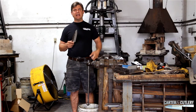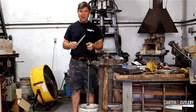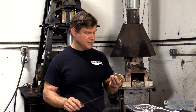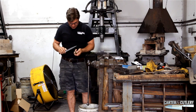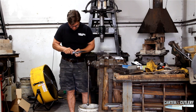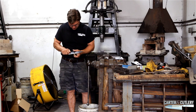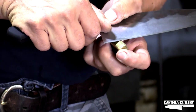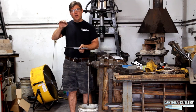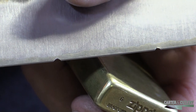One thing that I'm prone to do when I get a knife back into my shop that has chipped — whether it's one of my knives or somebody else's knives, because we sharpen everybody's knives — is I'll pull out a lighter out of my pocket. This is a Zippo lighter; it's got some round corners. I'll put my glasses on for safety, and I'm going to flex the edge by pushing it down at about a 30-degree angle to the corner of my Zippo lighter and try to deflect the edge. I want to see that steel ripple away from the pressure of the Zippo lighter, and then when I remove the pressure, I want to see the steel go right back to where it was before — kind of flexible like a spring.